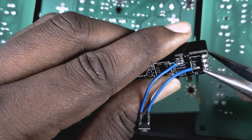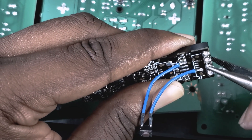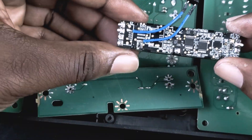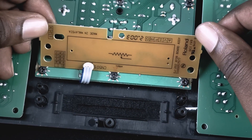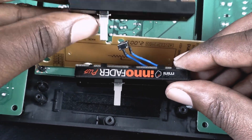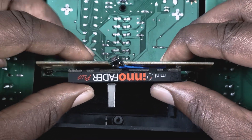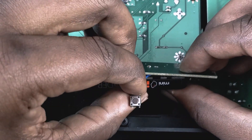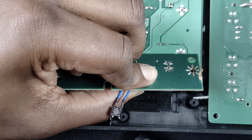Bending these pins down does create a little bit of surface tension on the PCB, so I'd highly recommend taking a moment and deciding what works best for you and what you believe to be reliable. For me, the blue cables connected to the switch are just as thick as the bent-down pins. When I lined up the holes and placed it back on the PCB, it was still a little thick and I had to apply a little pressure to get enough of the pins to protrude out the back of the board. Any amount of pressure can cause issues, especially when the board heats up and cools down — it tends to flex and could cause issues later. I also kept in the mistakes I made during this installation — I added a little too much solder to one of the pins and had to clean some off, but these are things that can happen and at least it shows you can correct them.